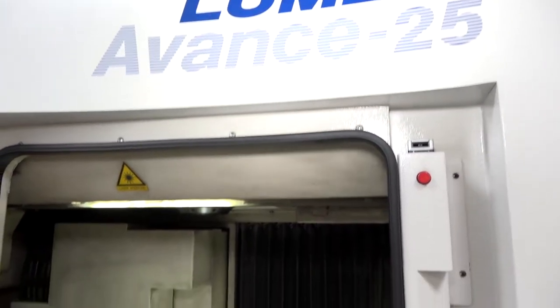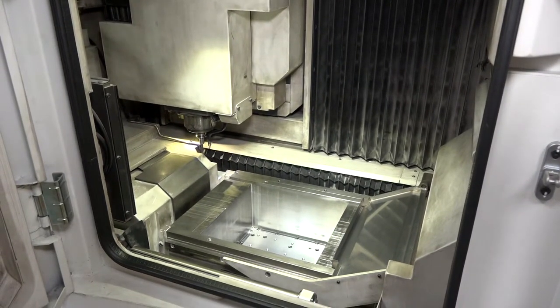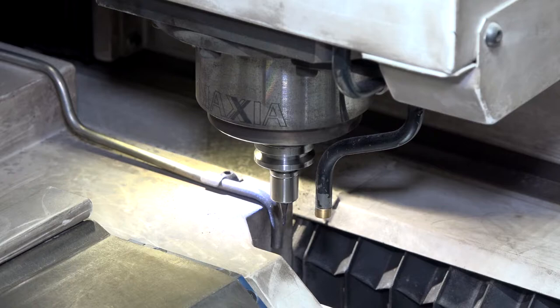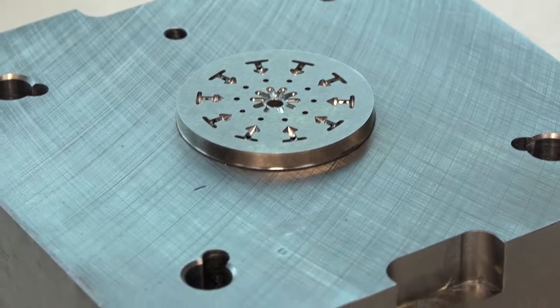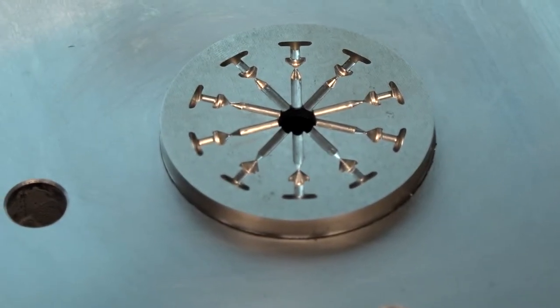It's a one-stop solution. Is this a metallic machine? This machine is purely based on metal powders. We also now have a printer that will print in plastic, to be introduced at MACH this year — we'll be selling HP printers. On the metal side, what metals can you do? We have a list of tested and proven materials: maraging steel, which is similar to P20 tool steel used for mold tooling, two types of stainless — 316 and 630 — titanium, Inconel, and cobalt chrome.